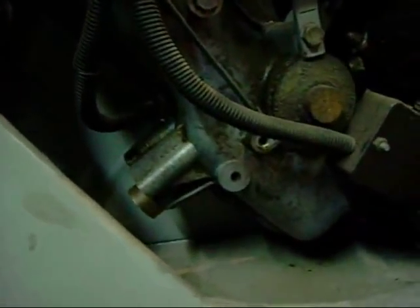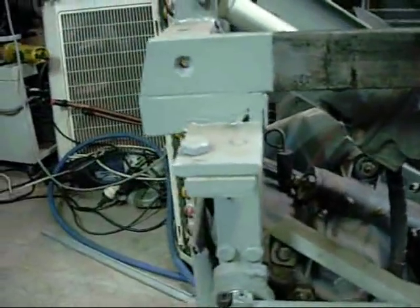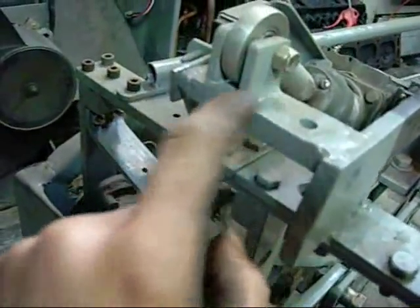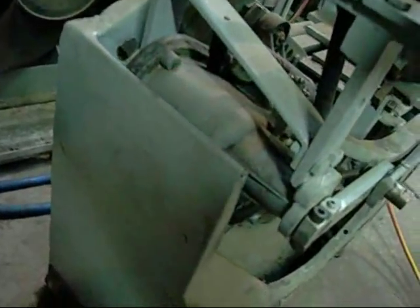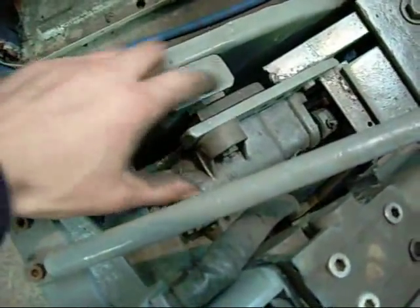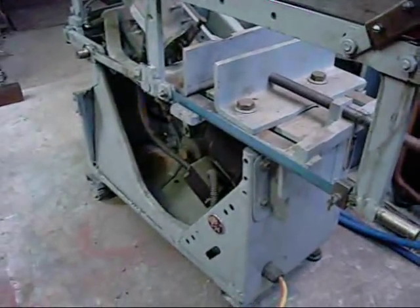All this gearbox is original washing machine, and this heavily modified cut-and-shut cabinet is washing machine too. That's about it — the rest of this is all scrap metal and spare parts. All these little felt wipers are handmade. Somebody spent a lot of time building this thing — all this is bronze welded, it's not arc or MIG welded. That block there is made out of wood; they have remounted and relocated this whole gearbox. It's actually very quiet and rather efficient when it runs as a hacksaw.